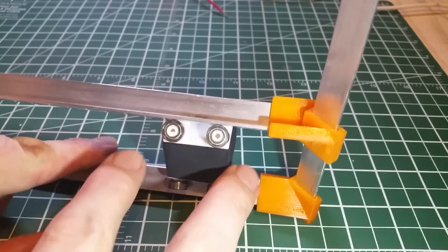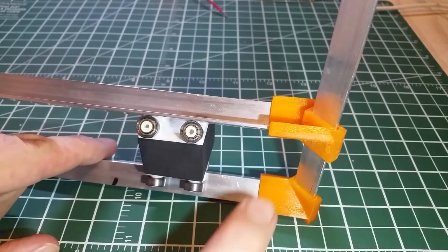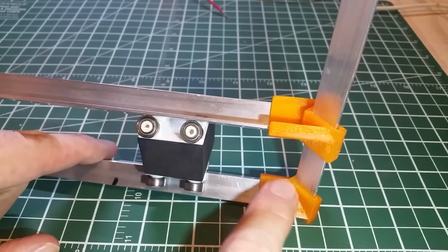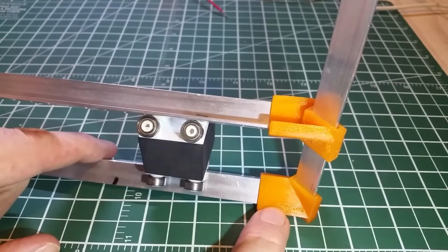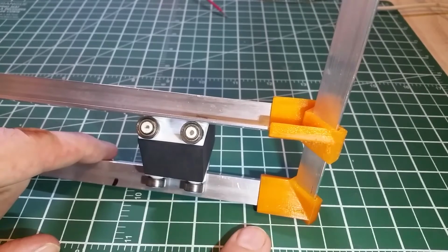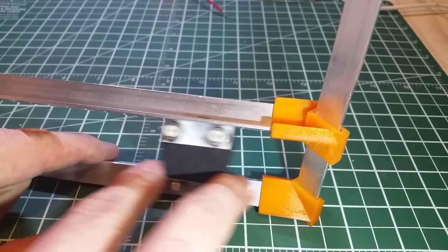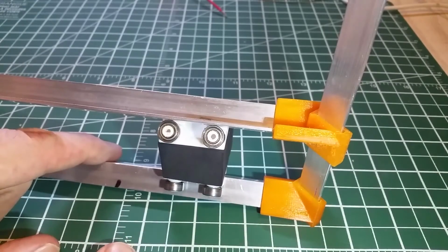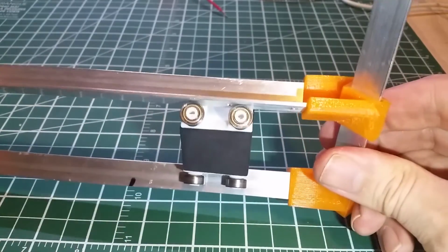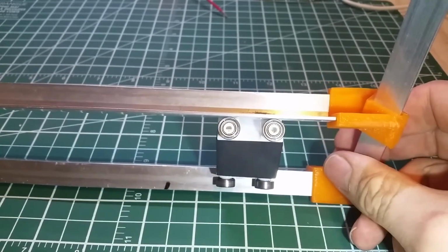And then of course you would have, starting with a very small 3D printer. The plastic in total in the setup is probably 30 cents, 40 cents worth. It takes about 2 hours on my little Fabricator Mini to print these because I have to make sure the layer bonding is really good. So high heat and slow. And then you got to sand in the crevices or whatnot. Same for the little trolley there, or the carriage. And you get nice strong parts. In fact, I thought they wouldn't be strong enough for this, but they're strong. Like, I'm trying to twist that there, and they hold up really good.